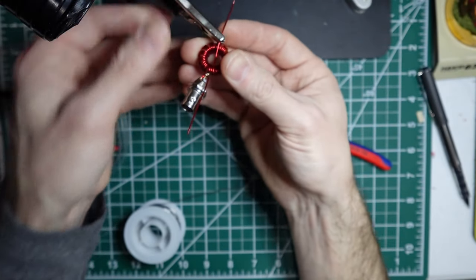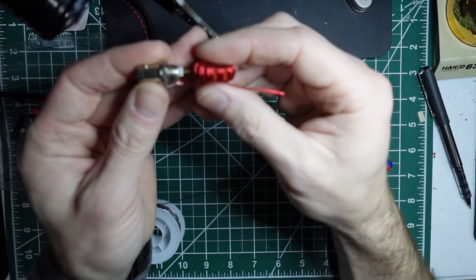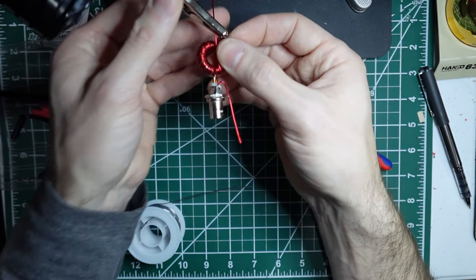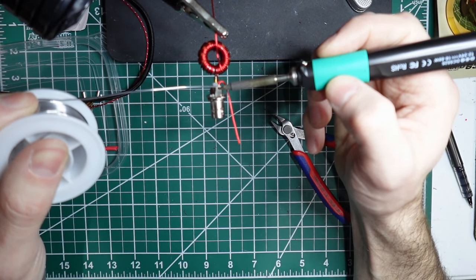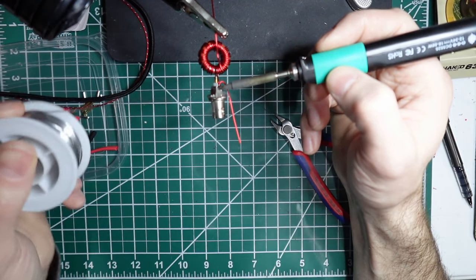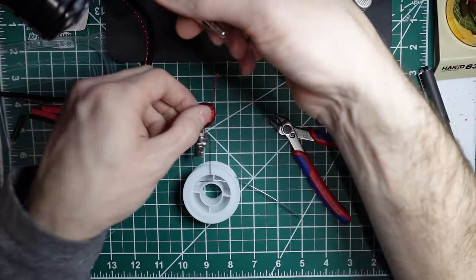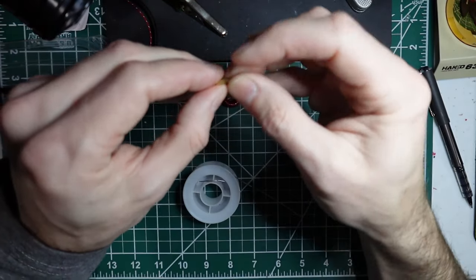And we'll flip it over. I like to also make sure that everything is laying nice and straight and flat. So in this case, I want to bend that up just a hair. Okay, and we'll solder the ground, or rather, the counterpoise connection. Okay, that looks good. Okay, and then take the female banana connector,